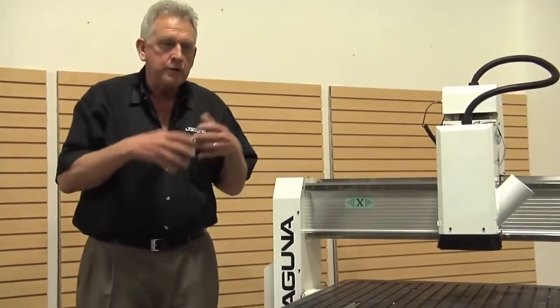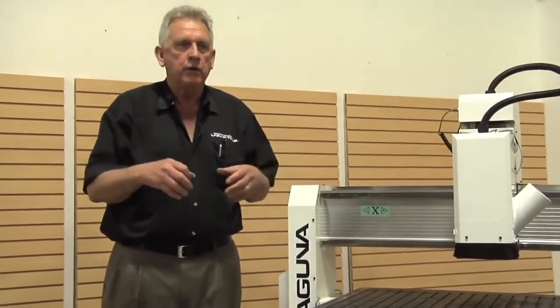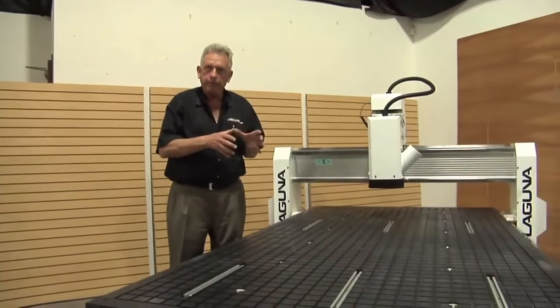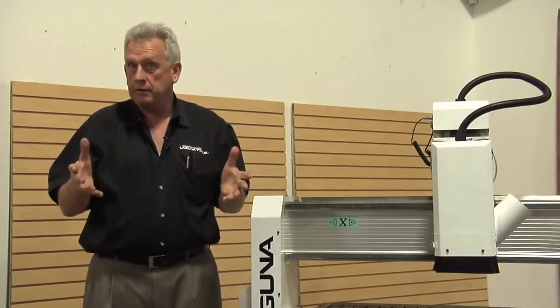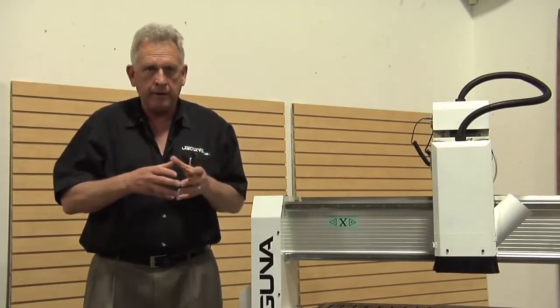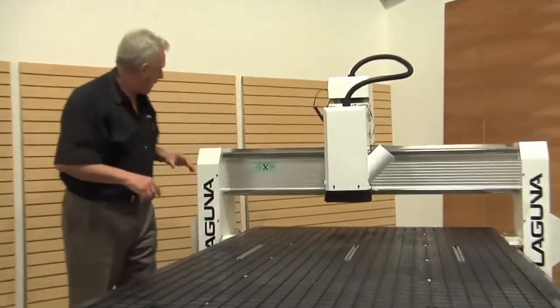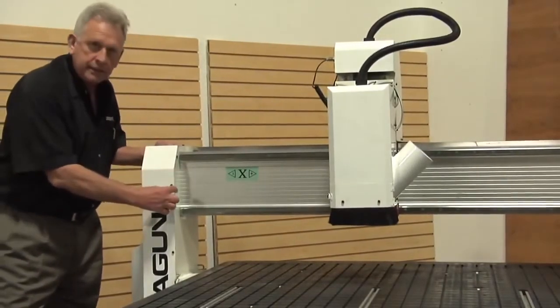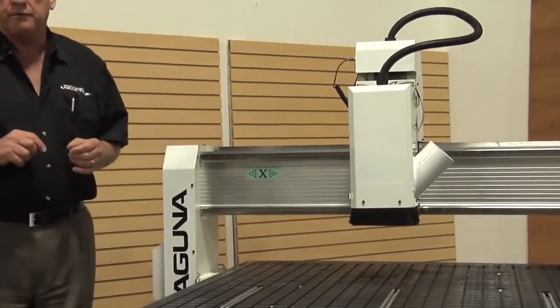The Smart Shop one has a 4 horsepower liquid cooled electrospindle. It's liquid cooled for a reason — we use these machines sometimes for long cycles. When you're doing 3D work, four or five hours is not unusual. Air cooled spindles tend to get warm after that period of time, and liquid cooled ones don't. We can basically run them continuously. If you run an air-cooled spindle long enough without an efficient fan design, you can have bearing failures over time. We've mounted the spindle on a steel tool plate, and the gantry supports under this cover are actually three-quarter inch thick steel plate, so the entire structure is very rigid — that's why you get good cut finishes on our machines.